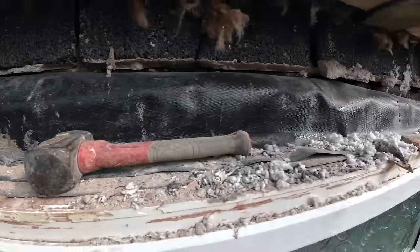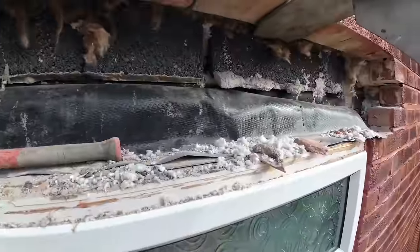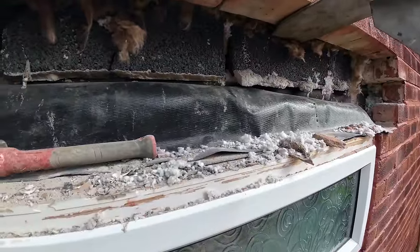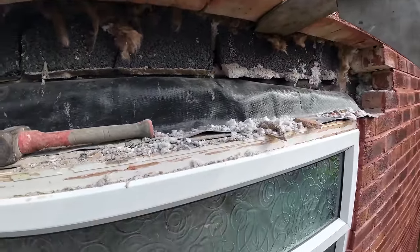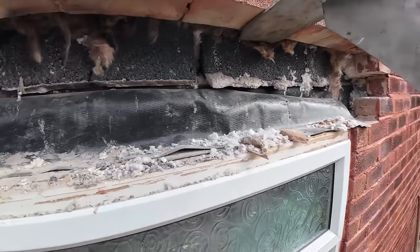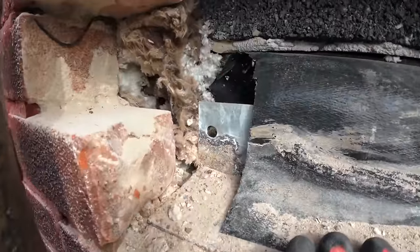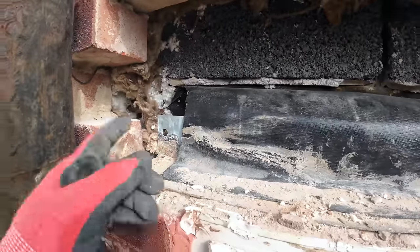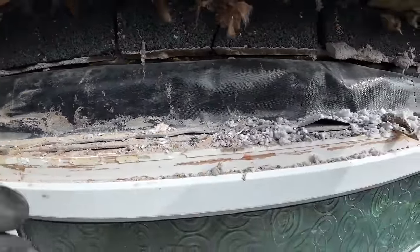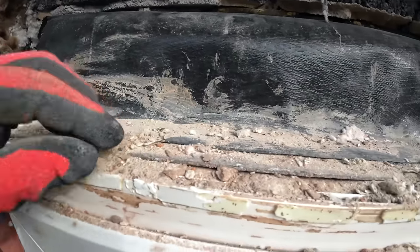So there you go. This is like how not to do a lintel. They've had a go with the tray, but that's where the positives end. The tray isn't long enough. The tray doesn't lap up. No vents. The lintel is set too far back and then it's just gobbed up with sand and cement, so